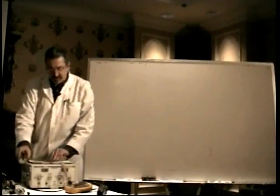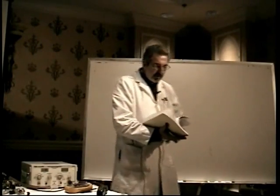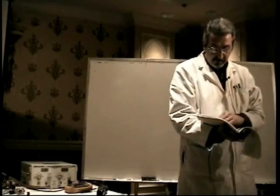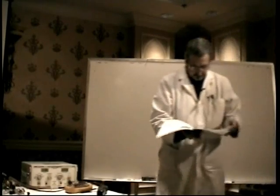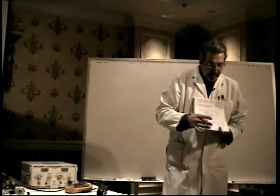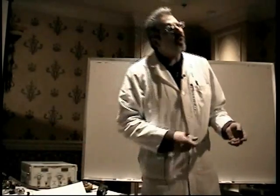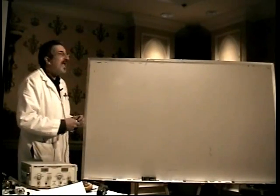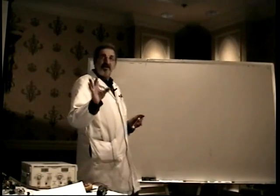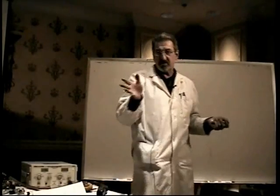Look at the horizontal deflection circuit, and we're still on the same page as the vertical deflection circuit with the block diagram, whatever page that was. What is it, 37? 37. Yeah. And here's a typical horizontal deflection circuit. Fortunately for us, the basic horizontal deflection circuit is more or less the same in every monitor. And also, fortunately for us, there is typically only one thing that typically fails in the horizontal deflection circuit.